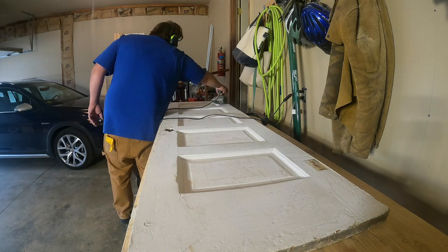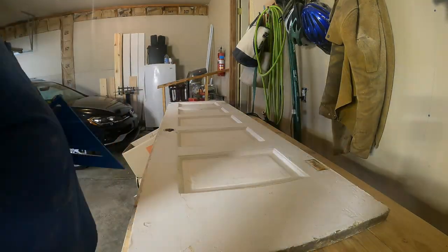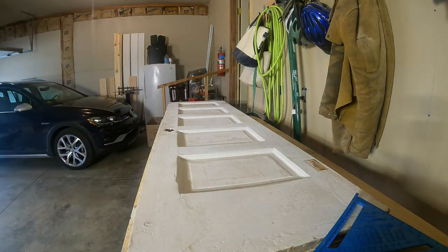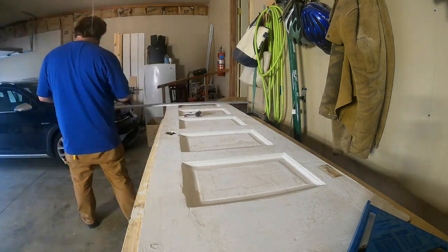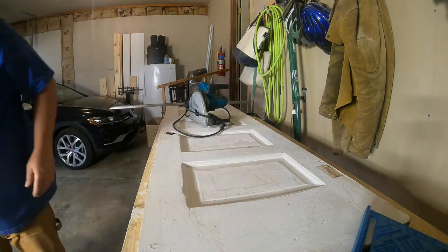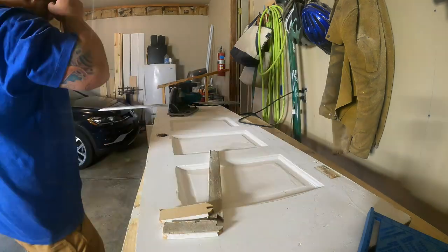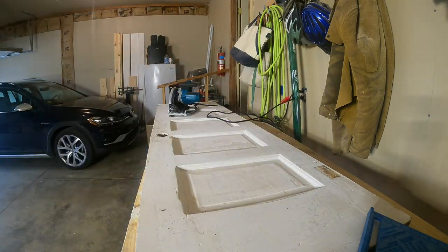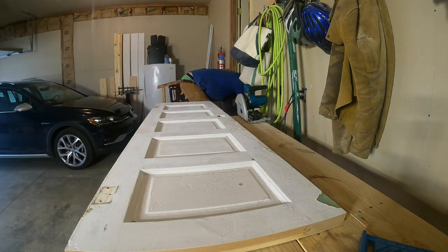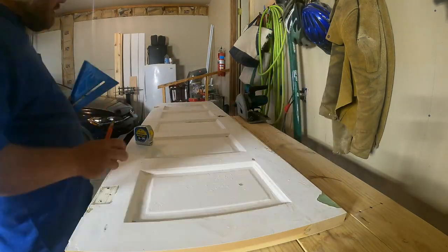The first thing I'm going to do is get it back to my shop, and I'm going to hit it with some pretty rough sandpaper, like 40 or 60 grit. I'm not going to take this paint off or anything. I'm just going to rough it up and take down all the high big chunks. I like the patina on this door. If you were going to take it all down, make sure you wear a respirator. Always be safe when you're stripping or sanding — it probably definitely has lead-based paint on it, or who knows what else. I'm just knocking it down a little bit, but not really digging into it.